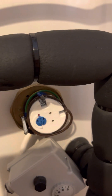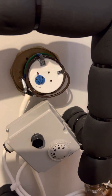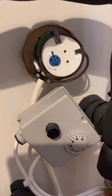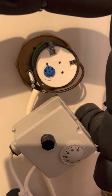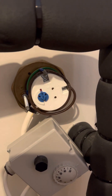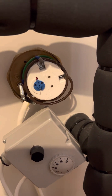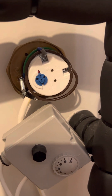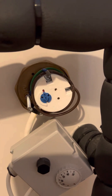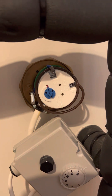I'll put that back, put the cover back on and do the screw up. If you've got voltage on there and it's not drawing any amps whatsoever, the immersion is probably faulty and needs changing — otherwise if the boiler or primary heat source ever goes down there's no backup, and instead of just a lack of heating you've got no heat and no hot water. Hot water is always a harder provision to put in as a temporary measure. Hope that helps, bye for now.